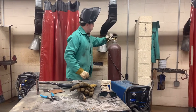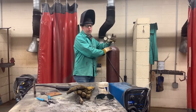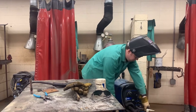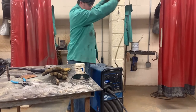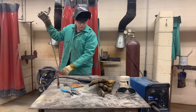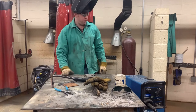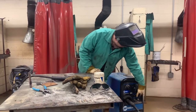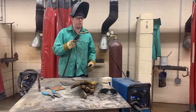To the welder — we're going to turn our bottle on. We're using 75-25 gas: 75% argon, 25% CO2. We'll get our ground lead. We're using electricity to weld — electricity to melt metal and to join metal together. We have to put our ground lead to whatever we're welding to, or a metal table that will conduct electricity. Now we can turn our welder on. This is your lead, this is your gun.